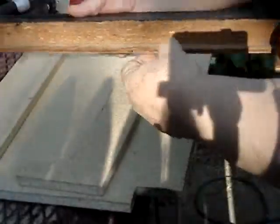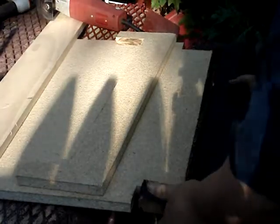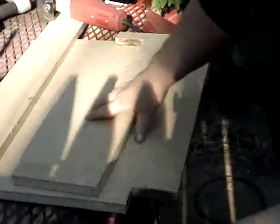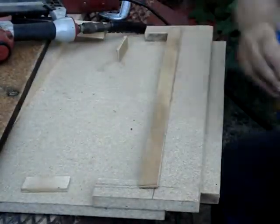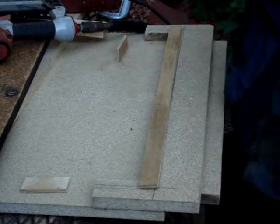Now what I have to do is take and cut this bearing, little stripping right here, so that it will fit on here, and that's basically how it goes. Of course, it doesn't have to fit this piece, it's got to fit this piece. So we'll cut our stripping out of quarter-inch plywood. All right, now I'm ready to put this quarter-inch plywood fairing with stripping on the underside of this.